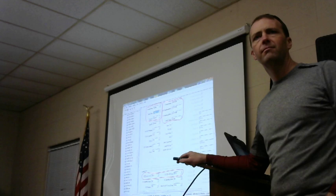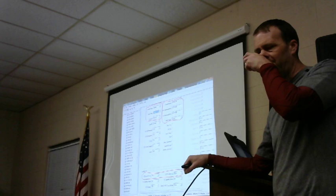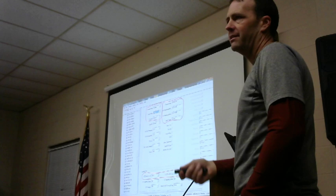Well, that's what I was going to ask then. Is that reverse burst similar to a tone squelch on an analog radio? Well, that's exactly what that is. Yeah, it's tone squelch. This wouldn't be available on a DMR channel. This is just analog only. So yeah, it's exactly the same thing. And it's debatable whether it actually works real well on Motorola.